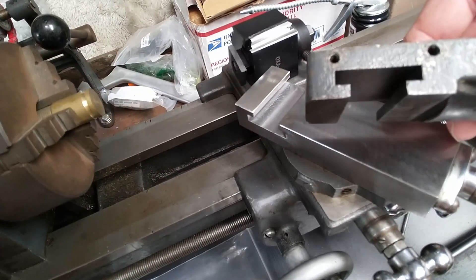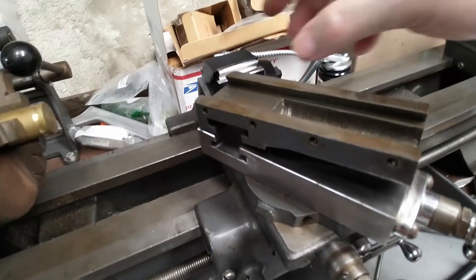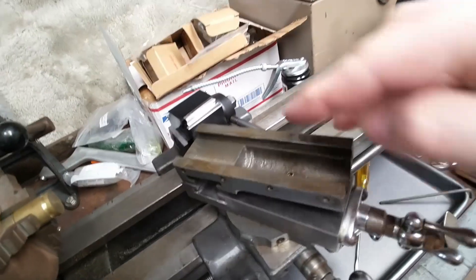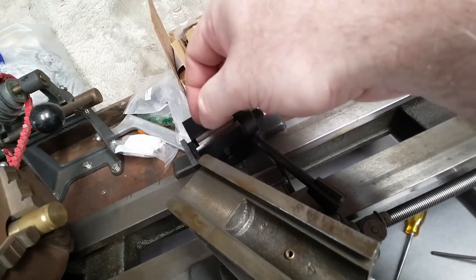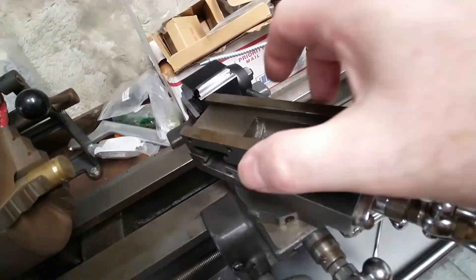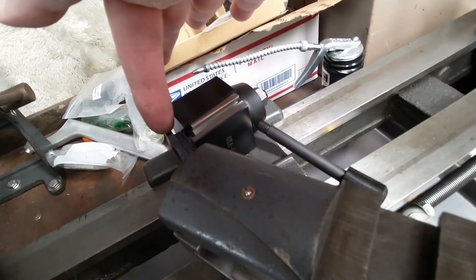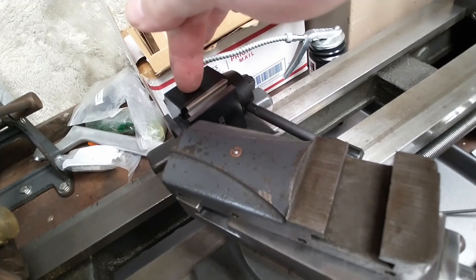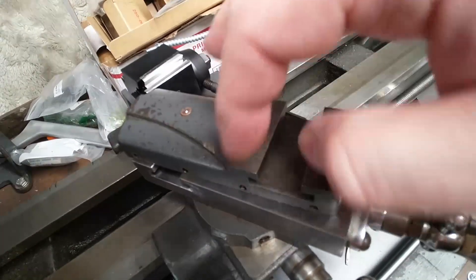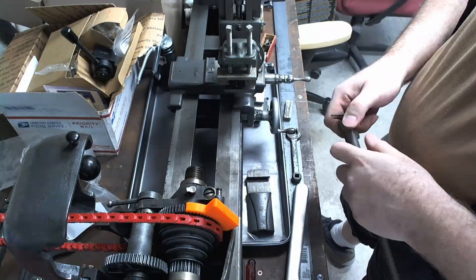I suspect that this is just slightly thicker than this — I have to measure it to confirm — but because of that, this is clamped down tight and up against the bottom of the tool post, but it still slides in and out, which is not going to work. The solution is I could take this piece and carefully sand, grind, or whatever, some of that thinner. Ideally you want a slight gap between the top of the T-nut and the bottom of the quick change tool post — that's what pulls it together and locks it in. If the T-nut is too tall, it locks in but can still slide. So my initial thought was I need to take some metal off there — maybe I'll see if I can get the milling attachment to work.